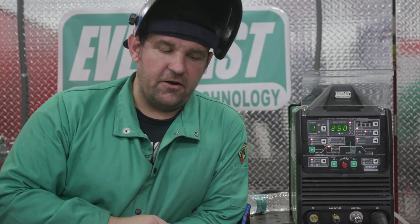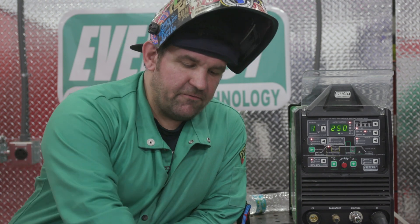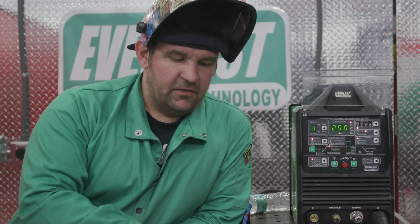So we just got done with all three tests with this water-cooled 20 series torch without a cooler — 50, 150, and 250 amps. This torch with a water cooler is normally rated at 250 amps at 100% duty cycle on DC. Without the cooler, we lasted maybe 20 seconds before it started getting too hot, catastrophic failure at a minute, and we almost lit ourselves on fire at a minute twenty. Even at 50 amps the torch survived, but surviving doesn't mean it didn't hurt the torch. If you constantly ran your water-cooled torch that hot without the cooler, you're going to degrade it and have problems sooner than you should. So let's always remember: if you have a water-cooled torch, run a water cooler. I'm Jesse McCollum, brand ambassador for Everlast Welders. Follow me on Instagram at mccollum.weldfab. Weld mean, weld green.